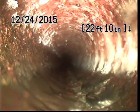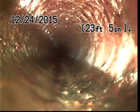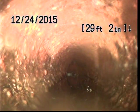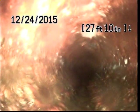As you could tell at the bottom left corner of our screen, you can see there's some water running, and that's because we do have a hose in the cleanout, and the reason for that is so that I can tell the slope or the grade of the pipe. For instance, here you can see that we start diving into some water. It gives me a good indication of the slope of the pipe, which is maybe one of the more important aspects to installing a sewer line.